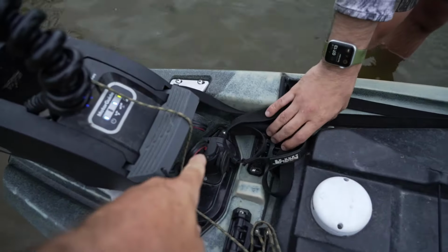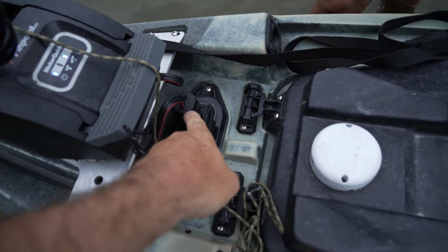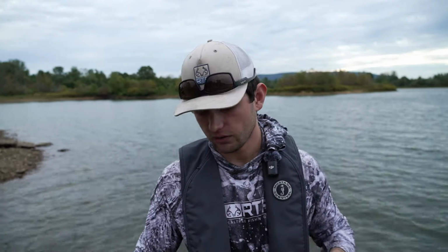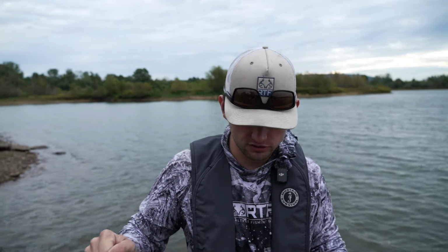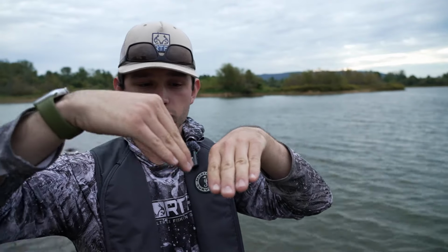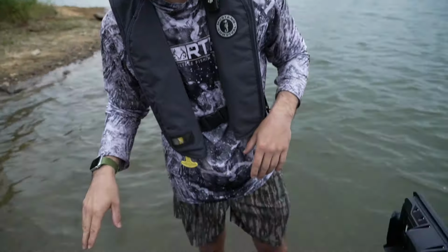All right, real quick before you go any further, I did see a post online about how this Marinco plug won't fit the power link plates from Bonafide. So the beautiful thing about plastic is it flexes. I know it's got that big oversized washer on the back that you use to pull everything together. That will fit in there. I made no modifications. You just kind of got to wiggle it back and forth. You put the washer under the lip on one side, and then you push and drop it in, and it goes in and out, no problem. We'll do a little side video on that.